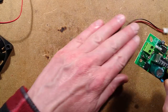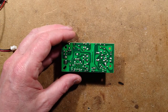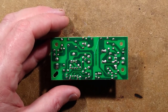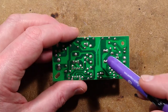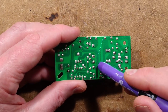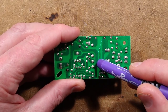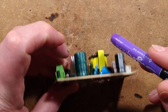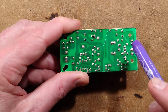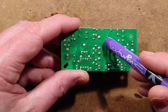The power supply. We may have to zoom down this little bit at the risk that we're getting so close that it's going to be an apocalypse for resolution. Here is the separation. There's a nice scratch across there. Here's the separation, which has been completely ruined by the fact they've put text right in the middle of the separation area where it separates the mains voltage side, which is this side, from the low voltage side. So they've violated the separation area with that text, the reference number.